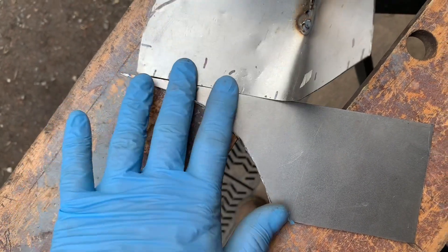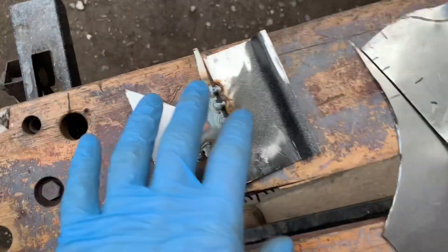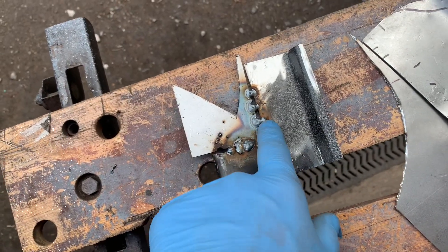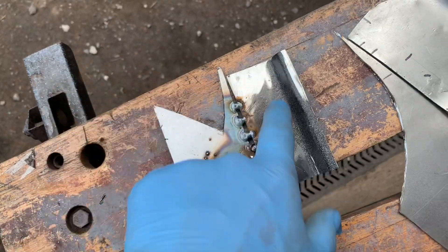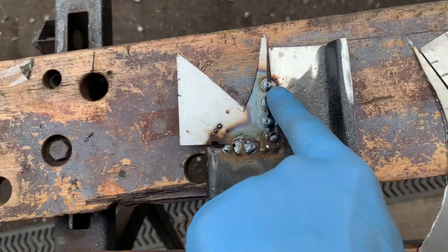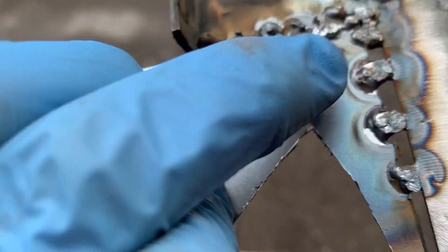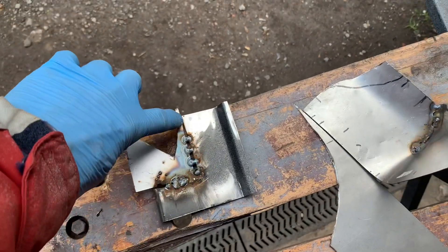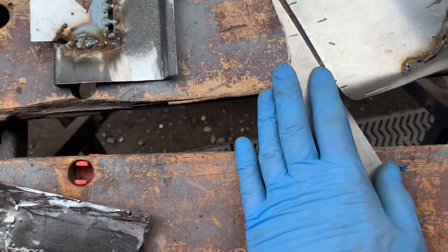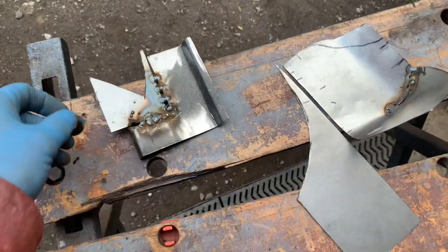By the time you grind all of this flat you may have ultra-thin welds holding it together. The way around that is to leave a gap. This is an exaggerated test piece I used when I was first welding — if you have a gap between the bits you're butt welding together, not a gap this big, and then you weld, you can be sure that when there are no holes showing you've got penetration and weld going all the way through. So when you're butt welding you're supposed to have a tiny gap between the two pieces that you're basically filling.